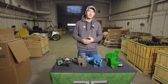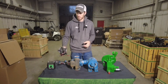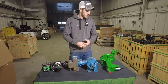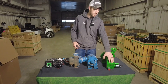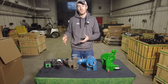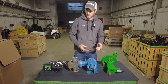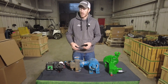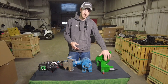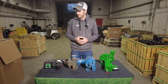The first thing we need to ask ourselves is how much flow do we really need? There are times where we cannot use an electric pump simply because it cannot push enough product. There are times where we may not be able to use a ground drive pump because we want to use a rate controller. A hydraulic pump we can use in almost any application, but they do require hydraulics and a rate controller. We need to decide: can the pump push enough product, and does the baggage — the rate controller, hydraulic flow, ground drive contact wheel — fit my operation? Do I have a controller in the cab to run a John Deere rate controller or Raven RCM? Can my planter have a ground contact wheel mounted on it?